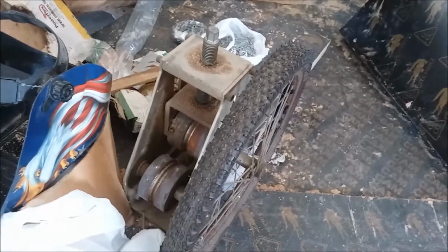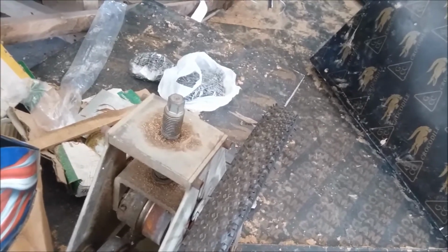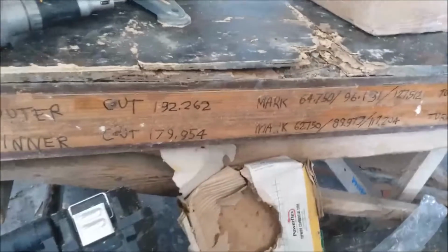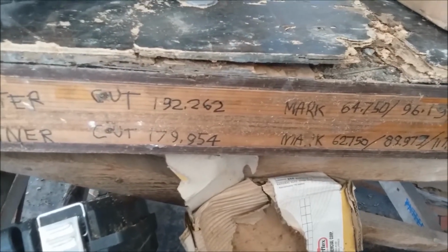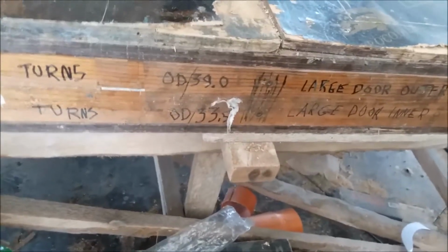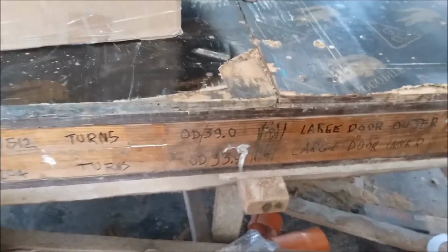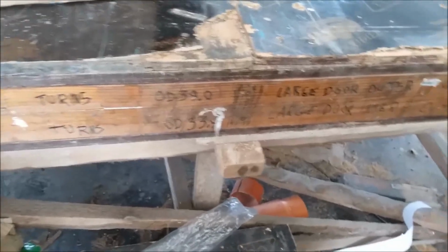Down here somewhere. That's a roller. 3-roller roller. You adjust it with this thing on the top. We count how many turns it is from when it makes contact. This is a chart of all the different diameter radiuses. And this is how many turns. It's actually flats. It's not 39 threads, it's 39 flats. We count flats because you take the wrench around once and it's 6, and second time 12, 18, 24. When you get down the end, you count actual flats.